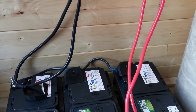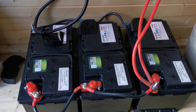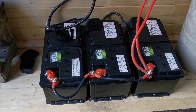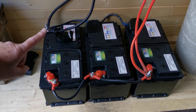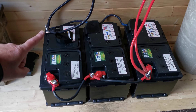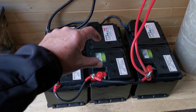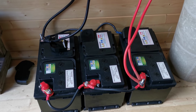On to the batteries — the guts of the system: three 110 ampere hour 12 volt leisure batteries wired in parallel. One of the top tips I picked up while researching is not to have your power outlet to the inverter go from the same battery. So I've got the negative from the left-hand side battery and the positive going to the inverter from the right-hand side battery. It would be a mistake to have the negative and positive to the inverter both from the same battery — all the juice would be drawn out of that one battery and the other two would just cascade into it. This way you share the power load and charging amongst the three batteries.